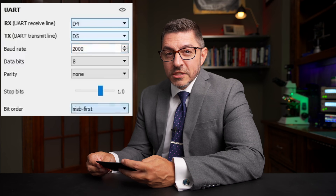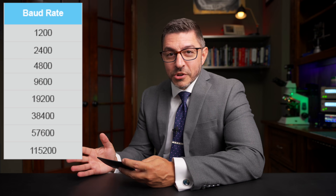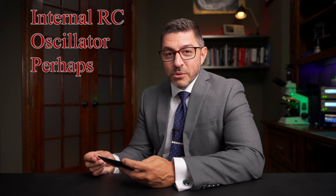He logged the data with a logic analyzer, and one of the things that both of the different groups noticed was that it's a kind of an odd baud rate — it's like 2,000 bits per second. Normally things are at 2,400 or 4,800 or 9,600, the whole kind of standard for RS-232 and serial protocols. This apparently doesn't conform to that, and they don't need to. They're talking to their own devices, so perhaps because of a cheaper clock frequency or just using the clock frequency they had, they stuck with 2,000 bits per second.